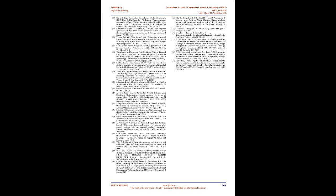Jabir et al. [30] presented a study on EDM to improve process performance, with responses of material removal rate, surface quality, and tool wear rate. Ton significantly affected the performance of the EDM process while machining titanium and its alloys. Sarkar et al. [31] studied wire electrical discharge machining (WEDM) of Titanium aluminide, selecting optimum machining parameter combinations for obtaining higher cutting speed. Kumar et al. [32] studied wire cut electrical discharge machining on Titanium grade 5 material using Taguchi gray relational analysis, considering multiple performance characteristics of the output response variables.